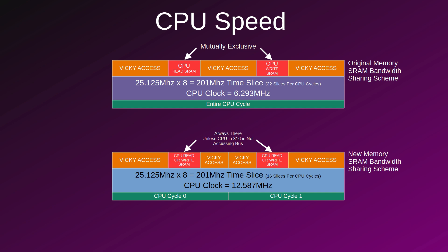Let's talk about the CPU speed. Originally, the idea behind having a slower CPU speed was to allow a shared memory structure, and in order to get good graphical features, I needed to have the most time for the graphical engine. The way I went about it was to divide a 201 MHz clock — which is basically 8 times the dot clock of 25.175 MHz — into 32 slices of time, and during those slices it could be used by the graphical engine and/or the CPU. In the actual core right now, I use 4 slices for a read transaction or 4 for a write transaction, and those are mutually exclusive during a 32-slice period. In other words, I would be using only 12.5% of the time for the CPU, and the rest could be used by Viki for the sprites, bitmaps, and so on.